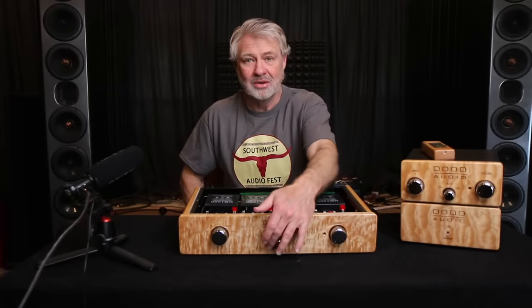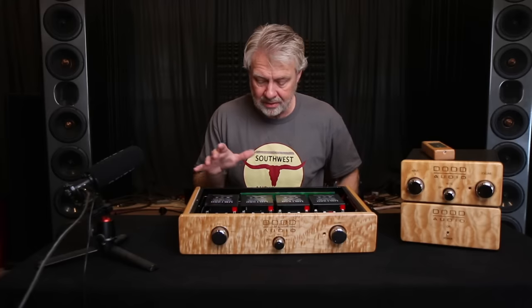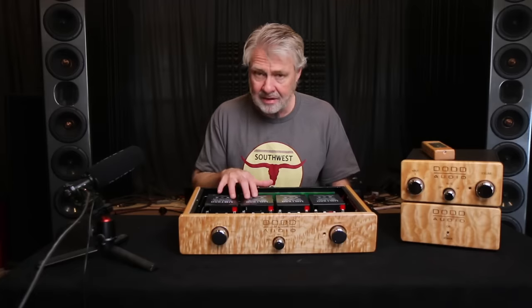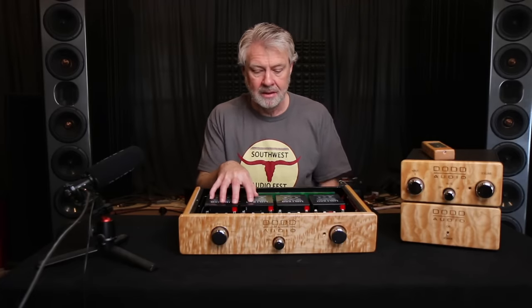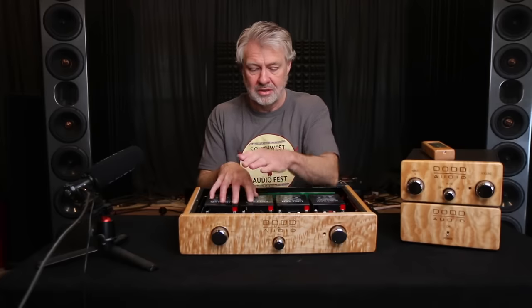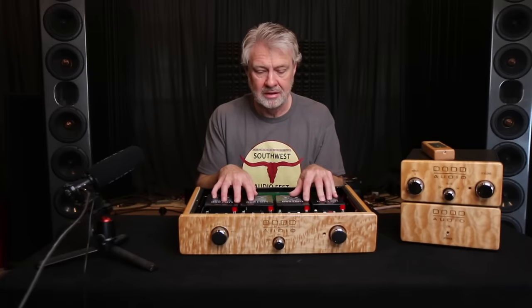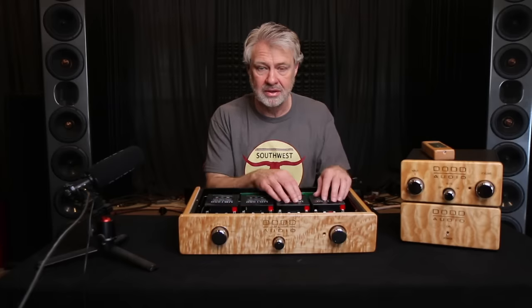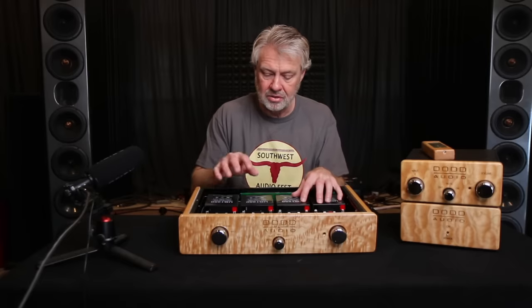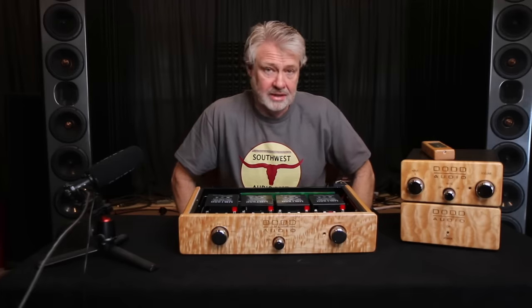This little ingenious design has two on-switches — on in one direction and on in the other direction. When you turn it on in one direction, you're running on two 12-volt batteries — five amp-hour batteries in series, running at 24 volts. While you're in the on position on this side, the charger is automatically charging the other bank of batteries. Then when the batteries get low, you switch to the on position on the other side. Now you're running off that bank while this bank is charging. So you pretty much have continuous use all the time.